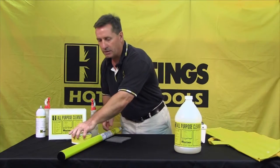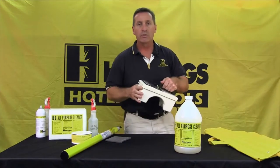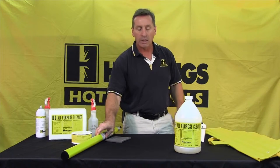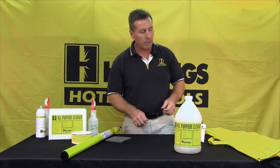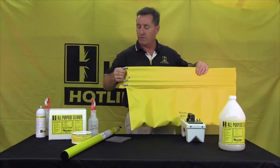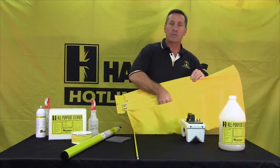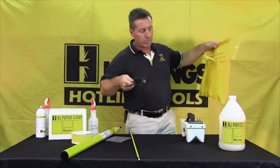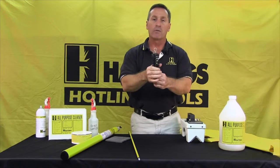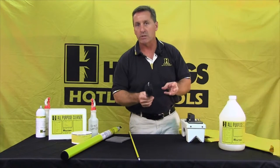For cleaning the inside of telepoles, there's a series of different hollow tubes. You can use the tester — the dry test will give you an idea what's going on inside. If it fails the dry test, take the stick apart and clean the inside. We have a cleaner kit for that, which involves rods of different lengths and different brush sizes to match the different tube sizes. With this brush, our hot stick wipes work very well — the wipe goes through the end, covers the bristles, and can be used to swab out the inside of the hot stick, leaving a silicone coating in there.